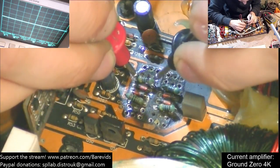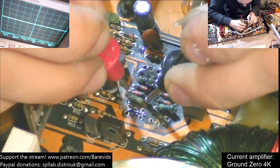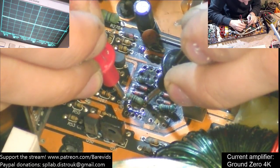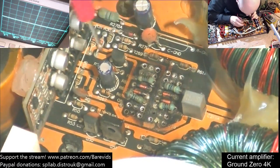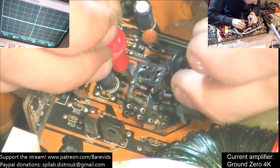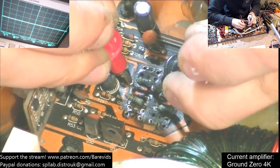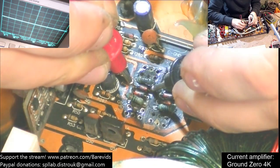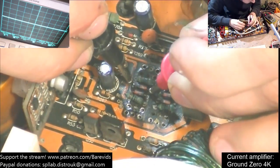This one reads 322 which is a little off, and this one's reading 466. I wonder whether that's due to the resistor being bad or whether there's something else in the circuit, because there are probably some solder bridges on the other side. This diode is reading 10 ohms, and this diode is reading 9 ohms. Whether it's the diode or whether it's something on the board - that's yet to be known.